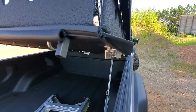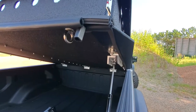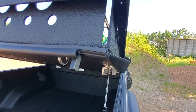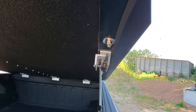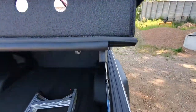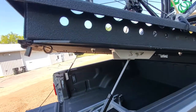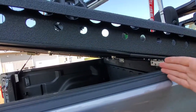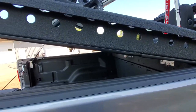So what I did — you can see here — this is a quarter-inch aluminum plate. I spray painted it with rattle can Rust-Oleum bed liner, but that's just quarter-inch aluminum plate. There are three-eighths inch stainless bolts coming through the top. It's four inches wide — I bought a four-foot long section. I didn't do the whole thing because I didn't know how far over to go and didn't want any interference, so I ended it a little bit early.